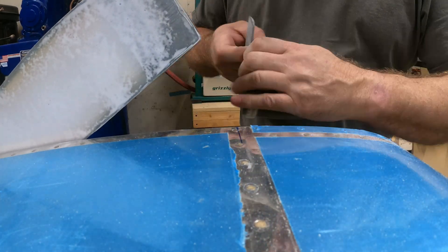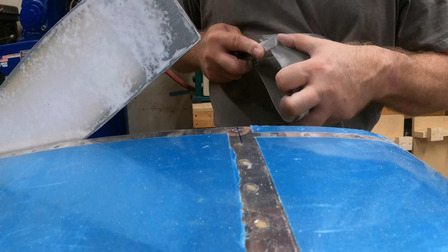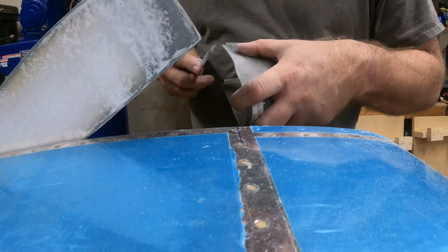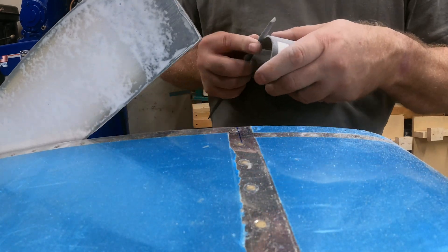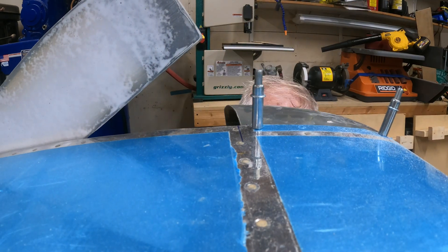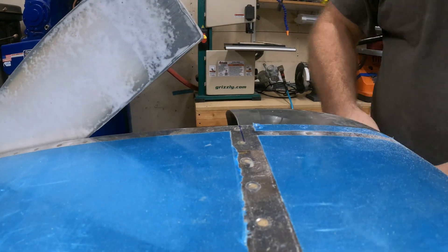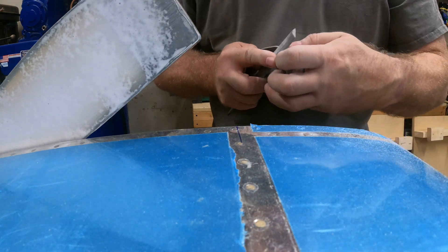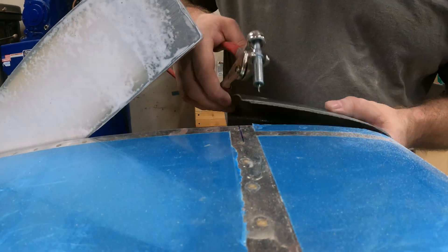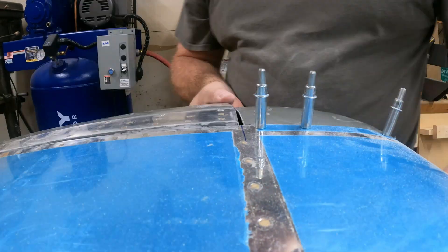Take it off — I've got lines on the other side. Start filing down to that 1/8 inch line on the other side as well. Looking from underneath, working it from underneath — that's the only bad part; I hate going underneath and looking up. Next thing will be to final drill to number 30 and get the fiberglass on there, then rivet it into place. Thanks y'all, bye.